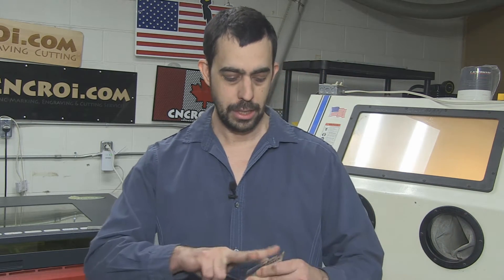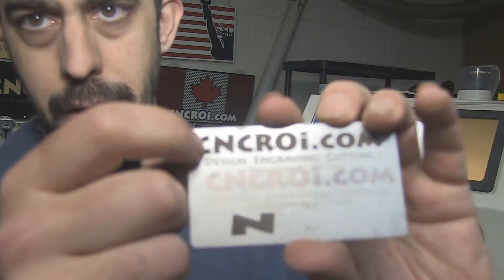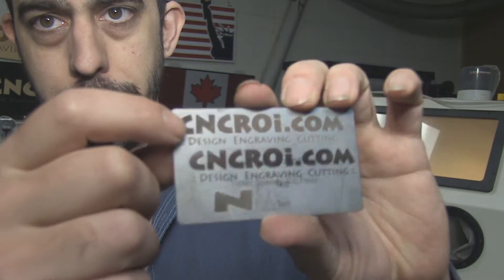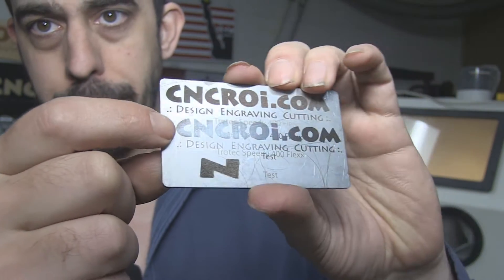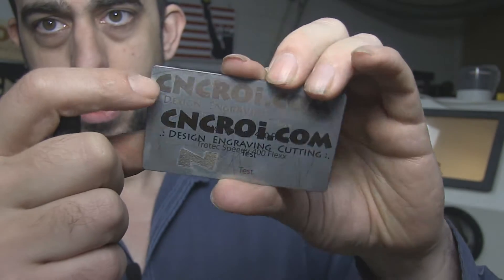Now there is a difference between etching and annealing. I'm going to move it around just to show you how it acts with light. The top part here is actually etching. Now it's not a pitch black, as you see with the annealing. This here is an extreme kind of etching — it's much, much deeper. For custom tags that go in the back of a machine, annealing is totally fine, very visible, and will last pretty much forever, in my opinion.